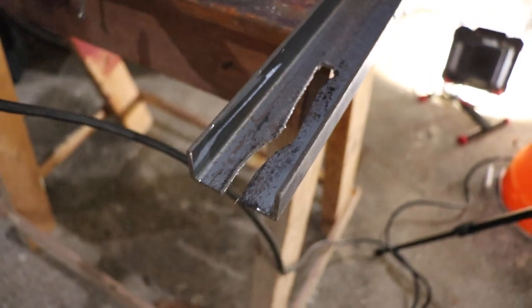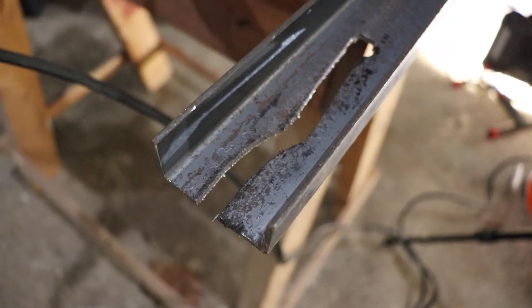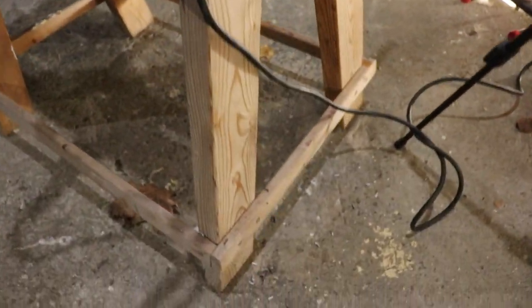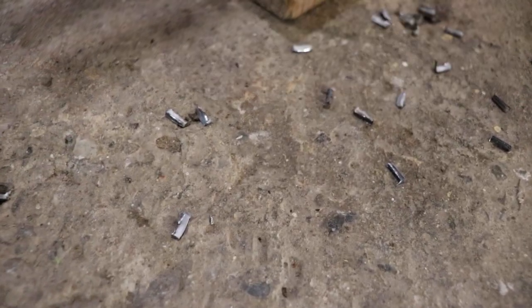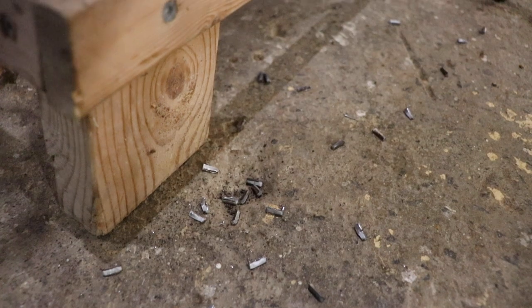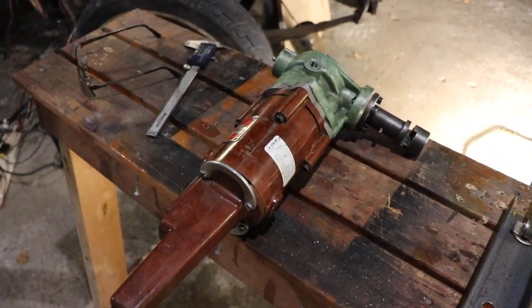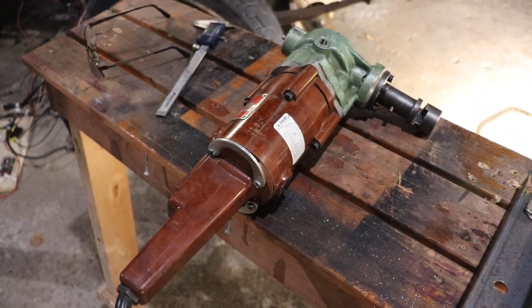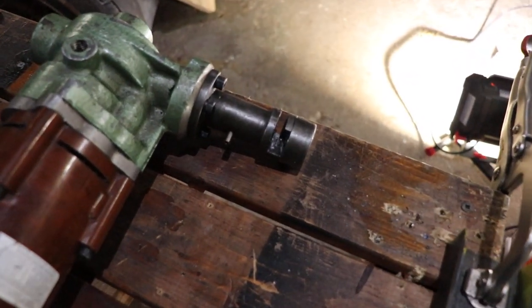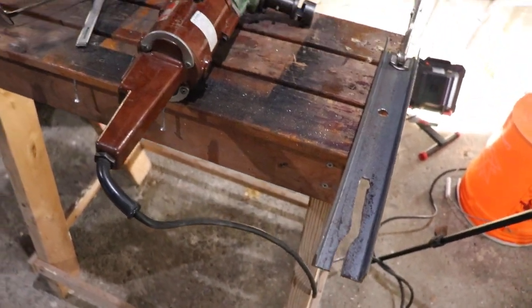I think that's pretty neat. That opens up some opportunities for cutting big pieces of metal — you don't need a plasma cutter and you don't need to use a torch or cutting wheel. Take a look at the bites on the floor here as well. So that's pretty uneventful — I'm pretty happy with that. You can't buy this company's product anymore; this was built probably pre-internet and I can't find much information about it. But there are other companies that sell nibblers, and you can get little ones that attach to cordless drills for sheet metal work. As you can see, this one goes up to 1/8 inch on mild steel. Thank you for watching.